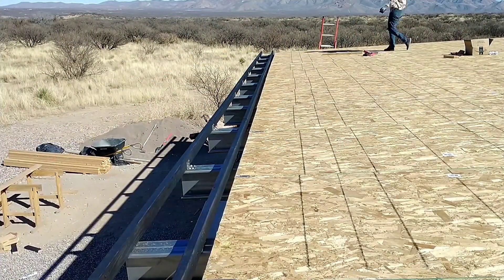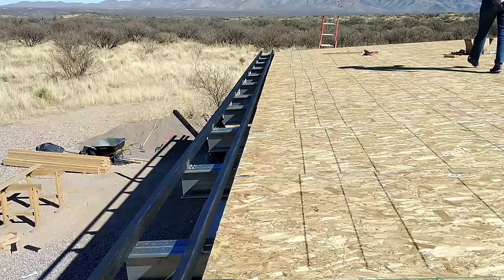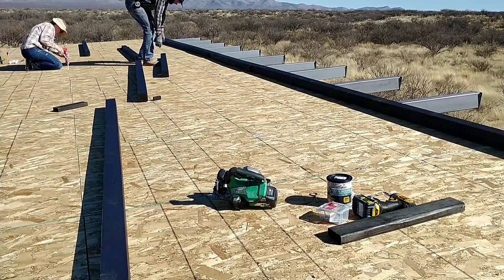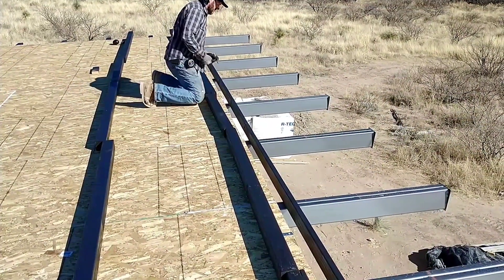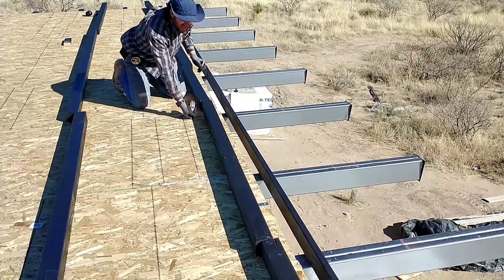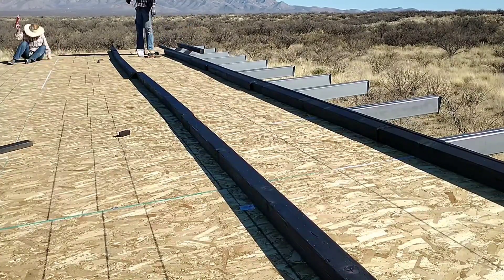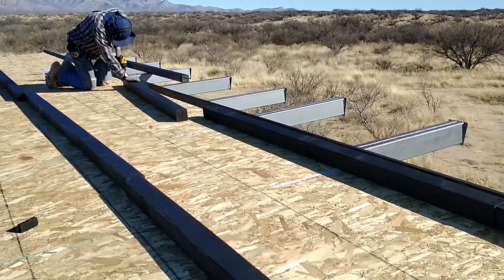It's finally time to move on to the 4x4 runs along the front. I think these are going to look really nice, but they are really heavy. April's up top and I'm handing them up to her, and then she's putting them in place. I pre-cut to exact length and pre-drilled all of these boards, hoping it all fits perfectly as planned. There are also different lengths of board, so I'm laying everything out and making sure I have the right boards in the right place in both rows, and that they're all going to line up in the middle of the beam with all the holes lining up. I snapped a chalk line for that first row, which will be in the middle of the beams.